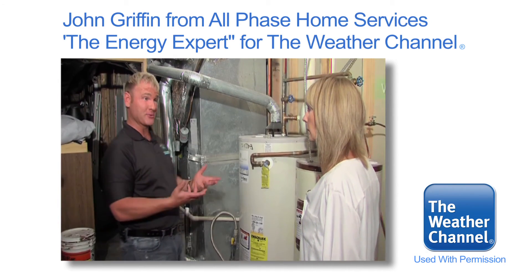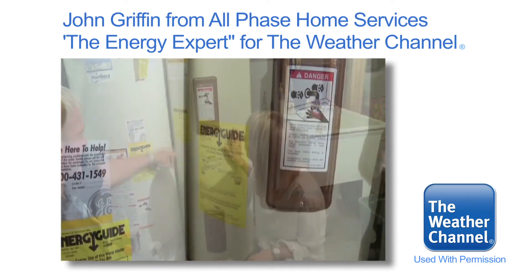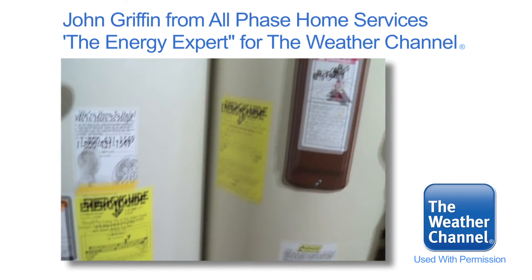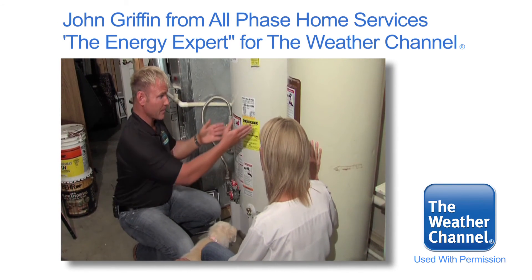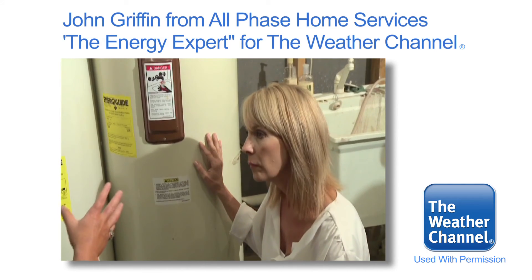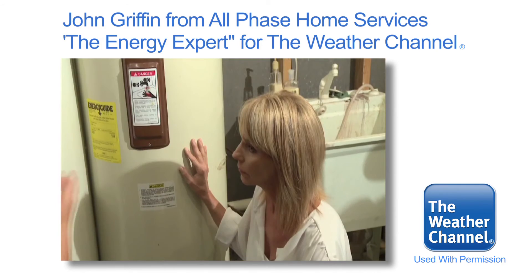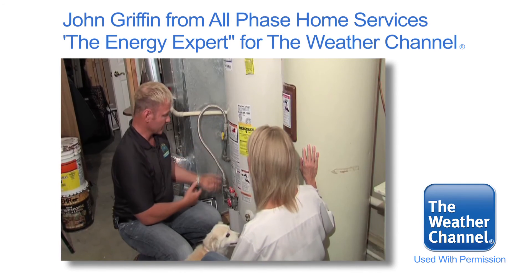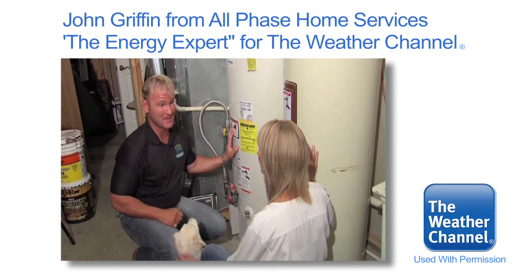Deloria, let's talk about how you heat your water. This particular tank is electric — it says it costs $420 a year. And this tank says it costs $235 a year to power. You have your tanks at the recommended setting, so they're running right. If you could do this differently, I'd probably go gas, because gas is a lot more cost effective than electricity. A lot of folks have their tanks cranked all the way up, so keep your tanks at the recommended setting and save some energy.